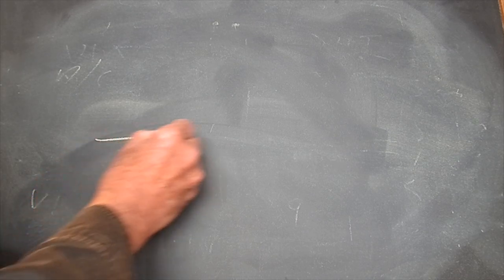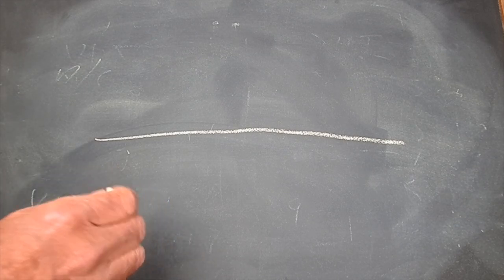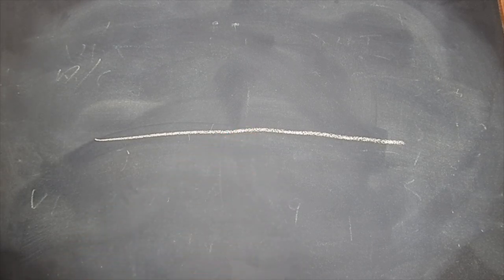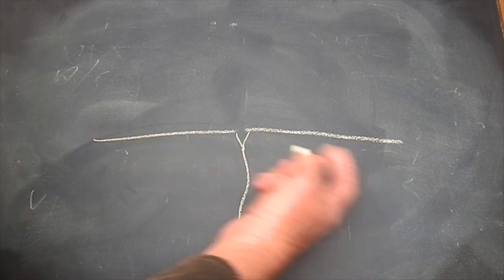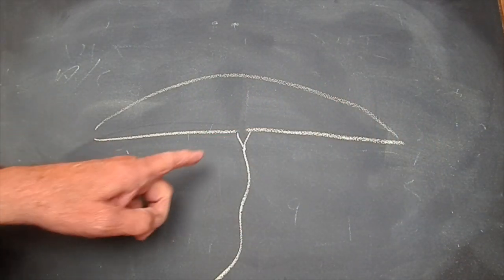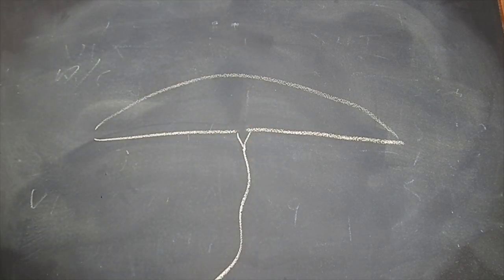Let's have a look at the blackboard. This is a half wave piece of wire — an aerial. It's a half wave on the frequency we're using. If you change frequency, it won't be a half wave anymore. The important thing is the current distribution. Let's say this is a dipole — we're going to feed it in the middle with coax. The current is maximum in the middle and minimum at the ends. The maximum current part is the maximum radiating part to get our RF signal out.